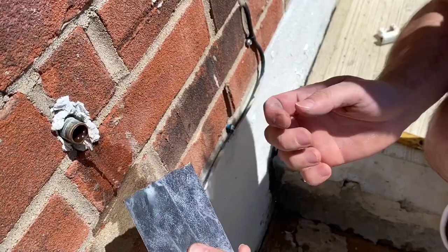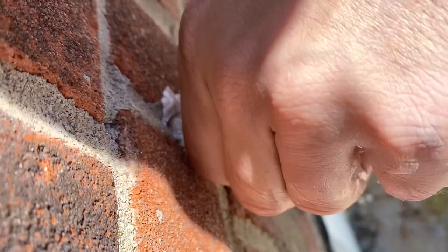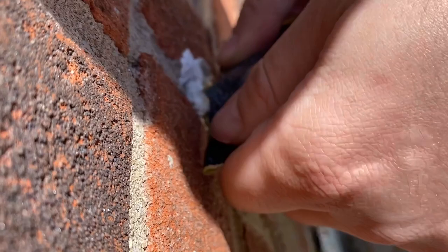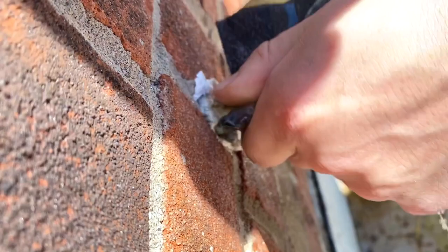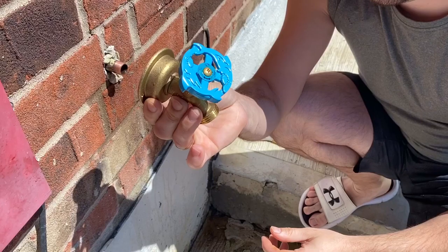Now the water is leaking. The next step is to get some sandpaper and make it wet. This way we can clean off the edges of the pipe, because you want the shark bite to stick as best as possible. See how dirty it was? You want to clean it as much as possible. If you have a really dirty pipe and there's some cement or caulking on it restricting it from being clean, you can always use tougher sandpaper. Looks like I won't be needing the more durable sandpaper because this pipe is starting to look real good. Keep cleaning until it is all cleaned up and ready to go.